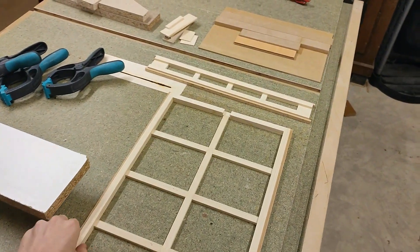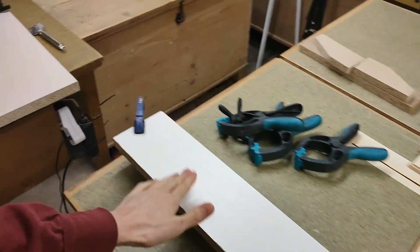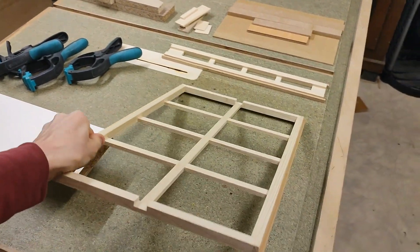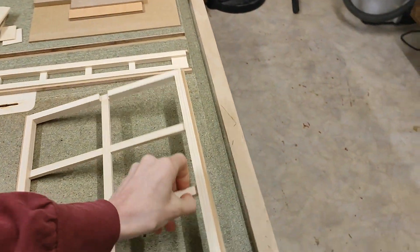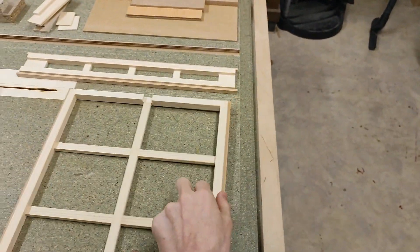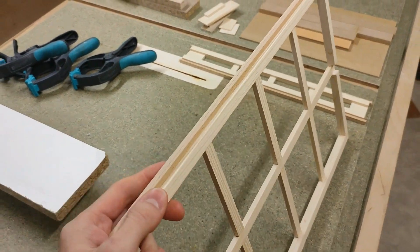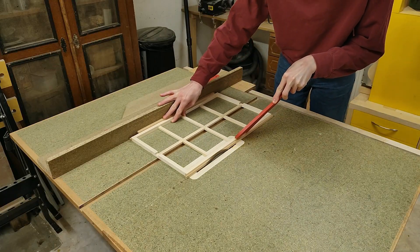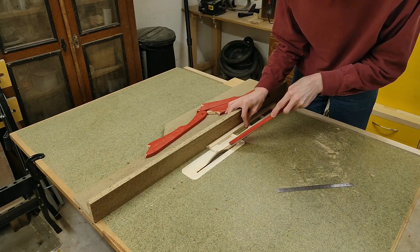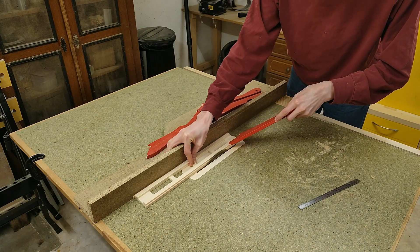We have ourselves the Y and the X-axis! It's very important to do the glue-up on a really flat surface, so as not to have things all twisted and bent to begin with. As you can see right now, the linear rails aren't much more than strips of wood. That's because only after gluing everything together can I start trimming them to shape — doing it this way allows me to achieve much greater precision. As things might be slightly off during glue-up, trimming to final width on the table saw makes the rails as parallel as it's gonna get using wood.